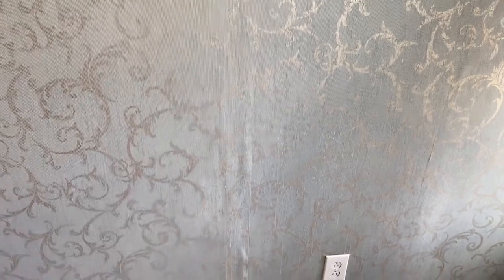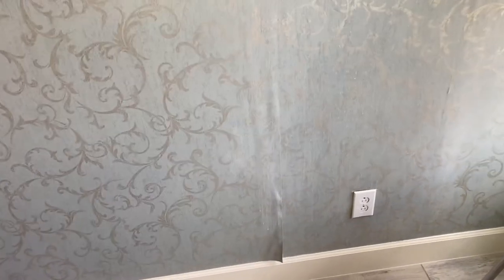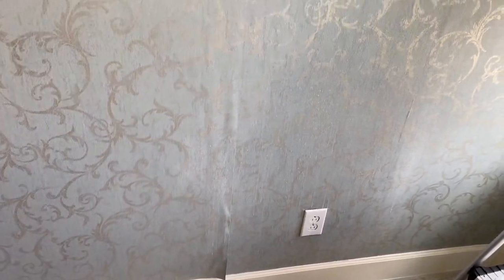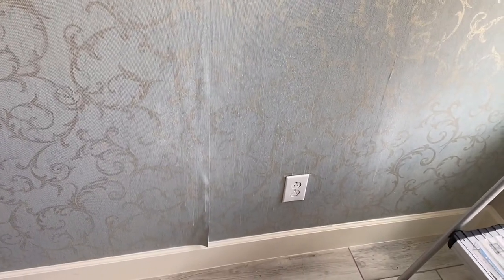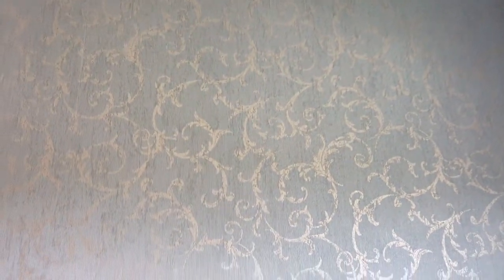And I think it's one of those things where a company goes through trial and error and then simply increases the proportions of those materials which make it bond to the substrate. We saw underneath this wall covering that the substrate was properly prepared. And so I would tip my hat to the installer and tell the company that owns the product that their glue, that their paste that comes with the ready mix that comes with this product is the culprit.